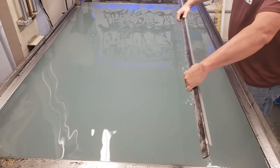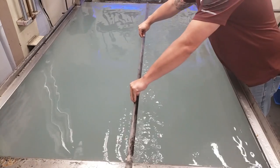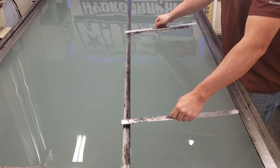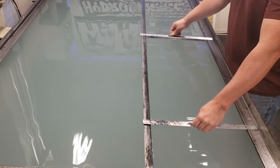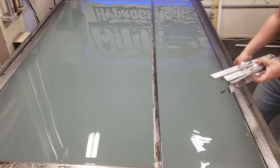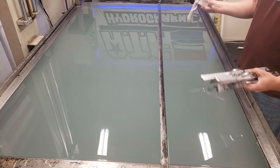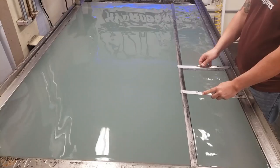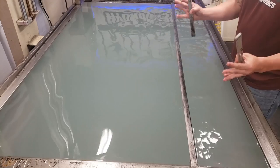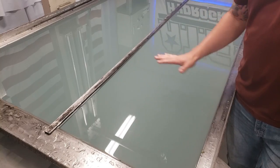In a big professional hydro dipping tank, we use what's called a dam system. This is just a stainless steel bar that I can slide back and forth to whatever size of film I'm putting on the water. For keeping the film from moving side to side, we use these aluminum dams that have a hook on one end. They go over the center crossbar and I can pull it into whatever size I need, and adjust the width however long my film is cut. I have them in all different sizes — probably about 20 or so different sizes that I use on a regular basis. This setup really is the ultimate in adjustability, though it's more for professionals because making all these different size dams and having a big tank gets really expensive.